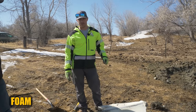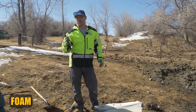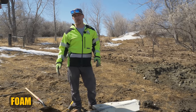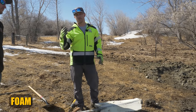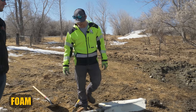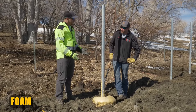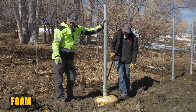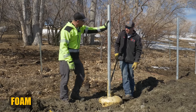We are seeing that foam is yielding some pretty good results. The one thing I want to test is side loading — but think about utility lines with wind blowing, 25 feet up in the air. There's a lot of side loading on those utility posts trying to work the foam free. If utility companies have faith in it, I think we can develop faith in it in the fence industry. This one floofed a little bit more — you could trim that off with a Sawzall if it's going to be somebody's fence. You can actually hear it ring through the post. Let's shake it.